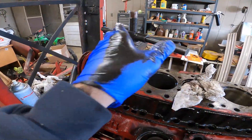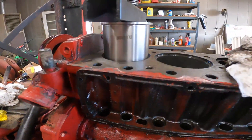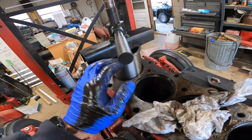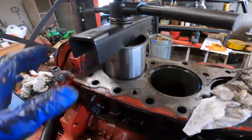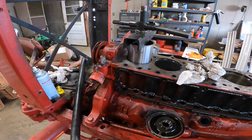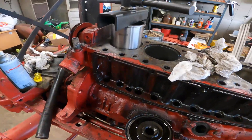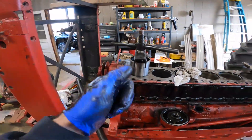It's definitely pushing it in - it's not crazy tight either. I can spin it by hand. It's sliding down in, and since it's one big plate, it's not just pushing on the edges - it's spreading force through both sides, so it's probably fine. I'm going easy because I don't want to break a sleeve and have to pull it back out with more money tied into it. We're going to go slow and steady. I like this setup a lot more than beating on it.